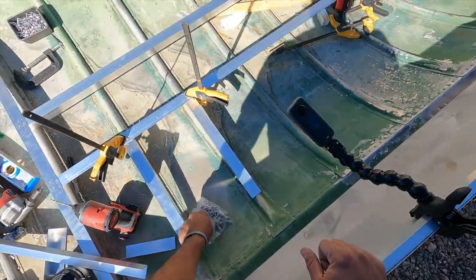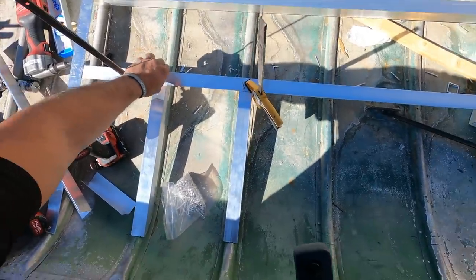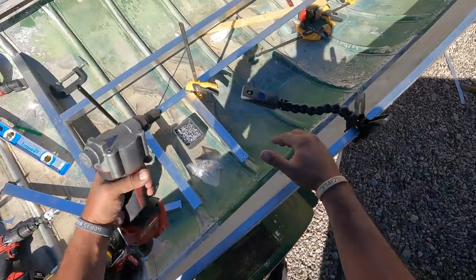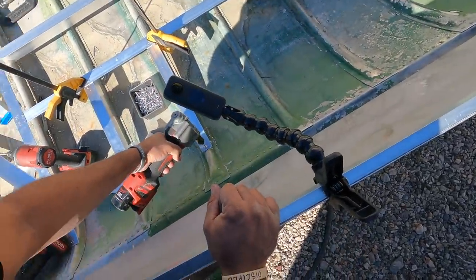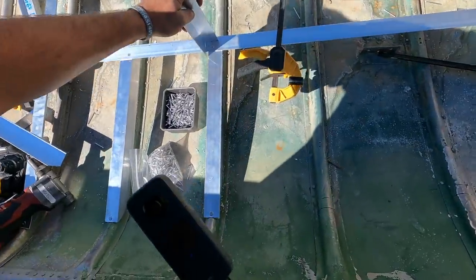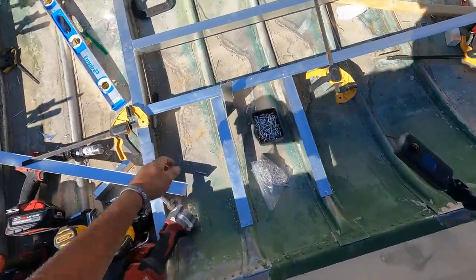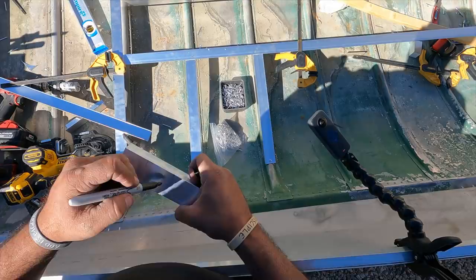I like working on a smaller boat — I can actually stand on the outside and reach in. You can imagine how much time you save by not having to go in and out. I am using straight pan head rivets on the end; they are stronger. On a boat doing this deal, you don't want countersink. Where the boat is visibly flexing all the time, countersink is a bad idea. Now before you put too many rivets in, it'll get real tight. So you want to use these pieces of angle — they're extremely useful. These little cut-offs — you can essentially frame your entire boat just using them.